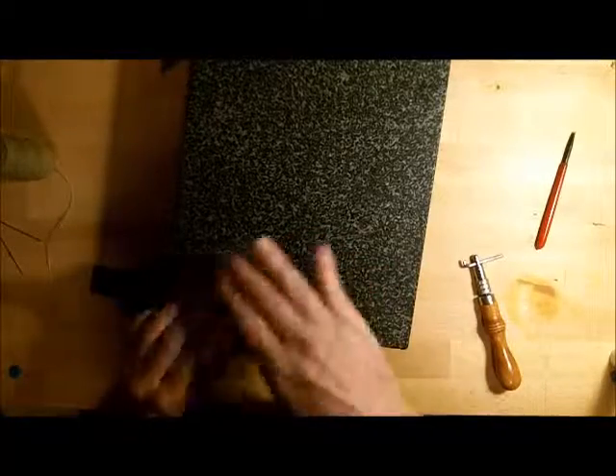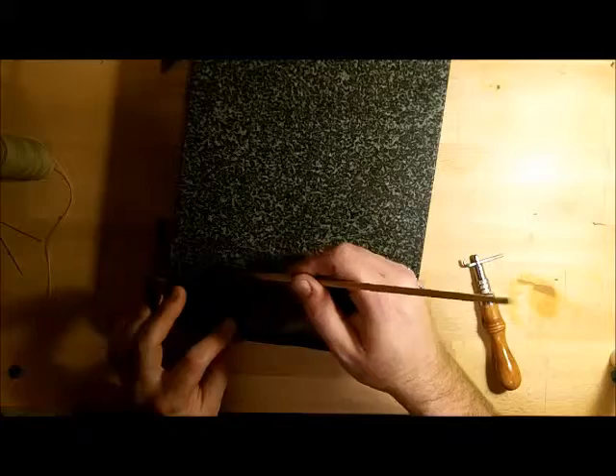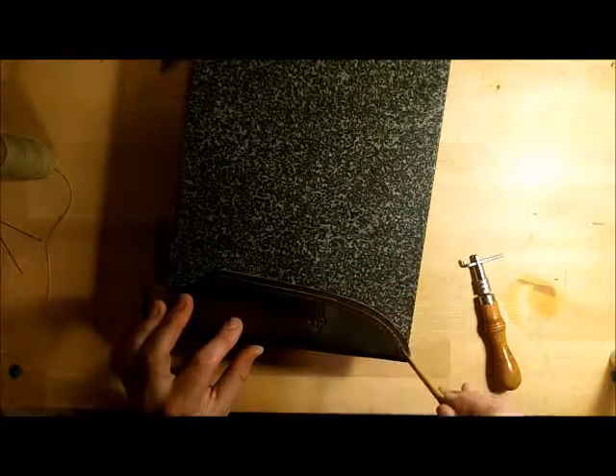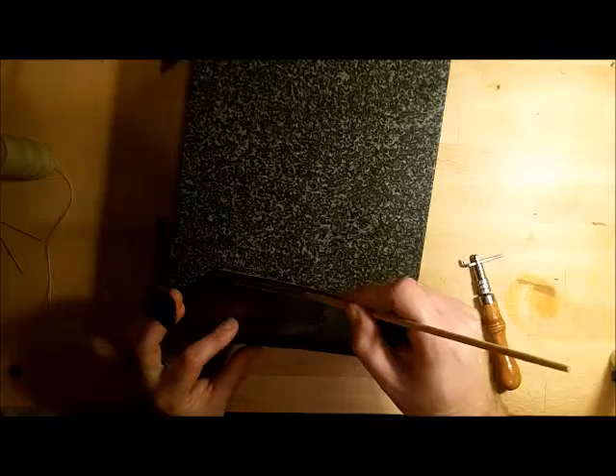Those can even be a little bit offset because I'm going to chase this around. Now before I do that — I've got a little artist brush here. I'm going to put a little water right in that groove to help me chase those groove lines around. I also have to dye this because I've just taken all the dye off. It sits fairly on the surface — you can still see it's darker, but I've pulled about a 32nd, maybe almost a 16th, of material off of there.